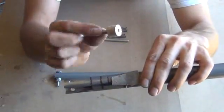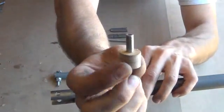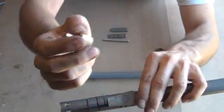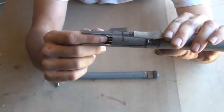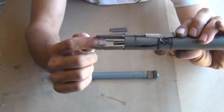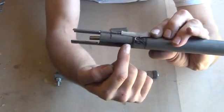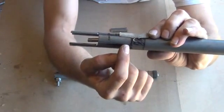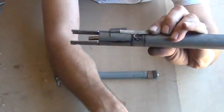The next step is this little piece — basically another hole saw plug — with a small piece of stainless steel tubing sticking out of it. That's going to give us our vacuum hose hookup. This piece slides in behind the last piece we put in, leaving a port for our hosing. It also leaves an air gap between that plug and the one-way valve at the bottom, which allows the spring and bolt to move fully — that's key to making sure it can fully actuate inside.